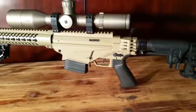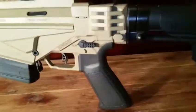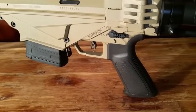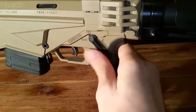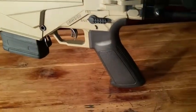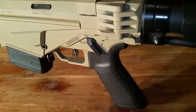What's cool about it is I designed it in SOLIDWORKS and then 3D printed on my Cubicon Single the selector switch. That's an ABS print — printed solid at 0.1 millimeters. It works perfect. I've tested it quite a bit. Very robust. I might end up printing it in a different material in the future, but you can see the custom serrations that I printed into it.